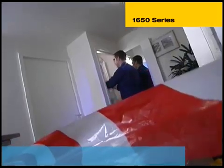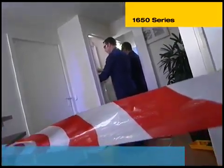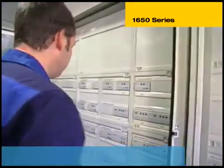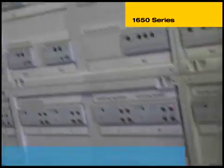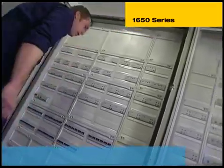Whilst testing is in progress, ensure that adequate precautions are taken to avoid damage or injury to people, equipment or property, and ensure that unauthorised persons are kept away from danger. Before being put into service, every installation must be visually inspected for any obvious violations or damage. The electrical testing can then commence using the ergonomically designed Fluke Multifunction Tester.